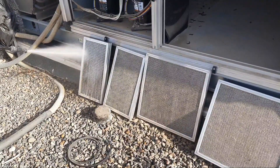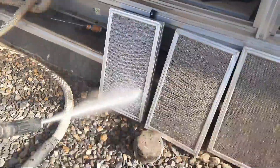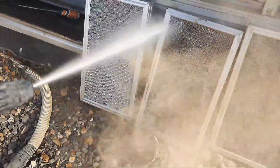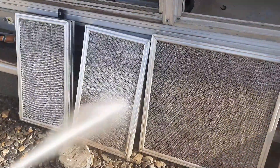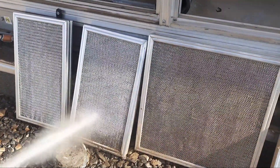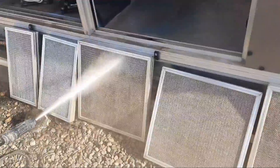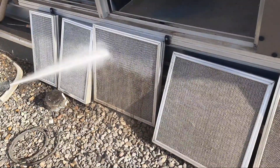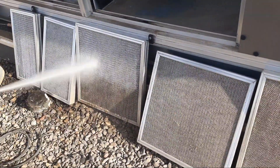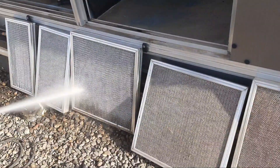You can see how much dust is inside here. Because this is a fresh air unit on the rooftop, there is much more dust coming in. You need to clean it properly every 15 days to prevent dust from entering your building.